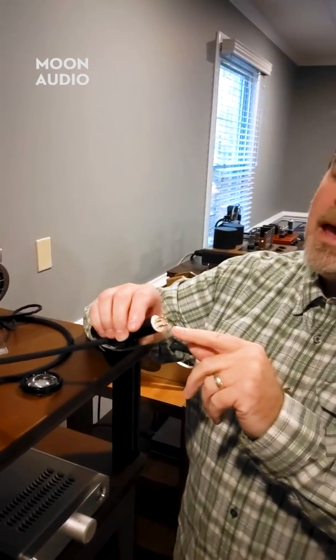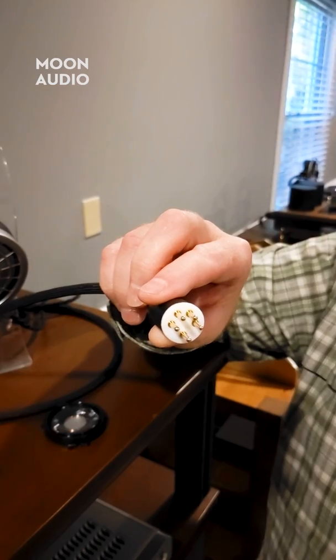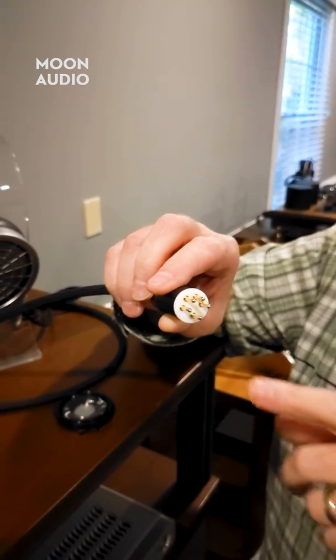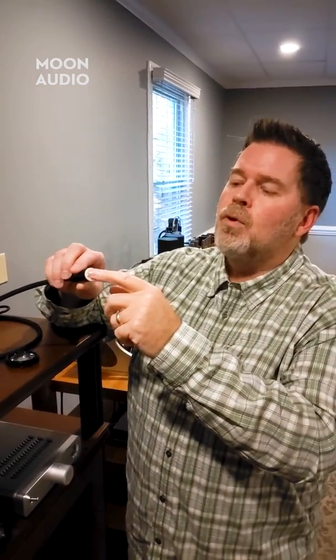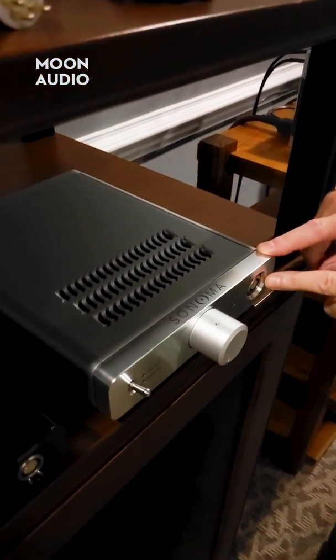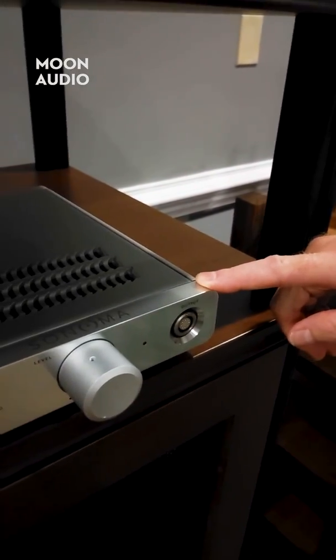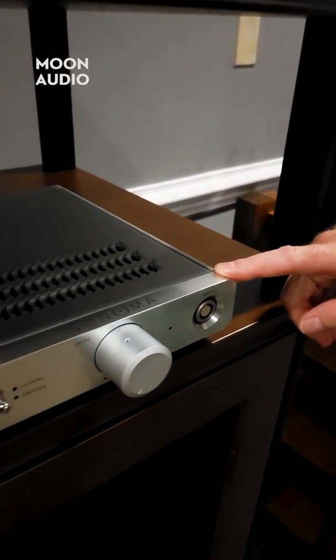That's why they use a much higher bias voltage — because they're only using the grid on one side. An electrostatic headphone requires a specialized plug. Stax uses a five-pin DIN connector; one of the pins carries that bias voltage to get the panels excited, and the other four are positive and negative for left and right. Looking at Warwick's Sonoma amp, they use a slightly different connector style but the same principles apply — a bias voltage and signal voltages passed on to the headphones.